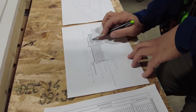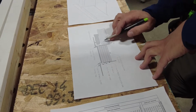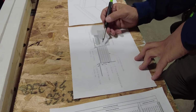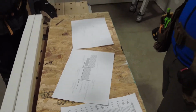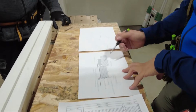There's only a little bit of insulation typically in the buildings when we get there, or we vac it out. So we're going to add more, right? This is the additional insulation, the new insulation. It's going to be higher. So we need to add a damming around there, right? A box, so that the insulation doesn't fall through the hatch. The next time the cable guy or the television guy gets up there to access anything in the attic, all that insulation doesn't fall down on his head, right?